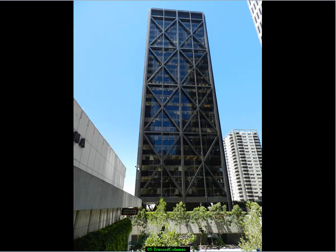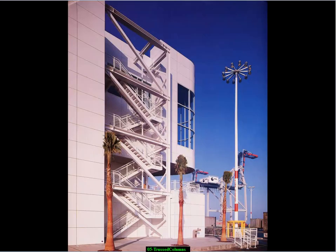So here the entire building is trussed, and we can either think of it as a column as tall as the building or as one of these columns that's from stable point, brace point, to stable brace point. We can do it with a pattern like this, or we can think of really elegant ways to integrate that bracing pattern. So for example, here we have a stair